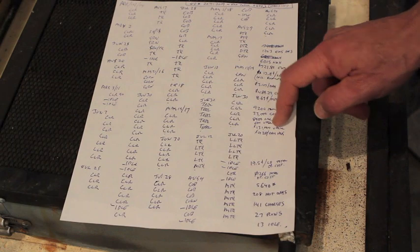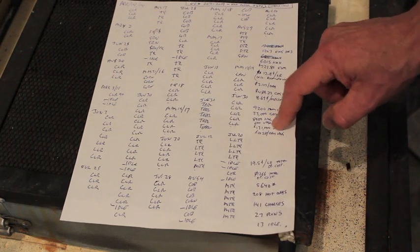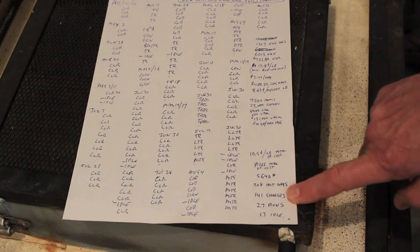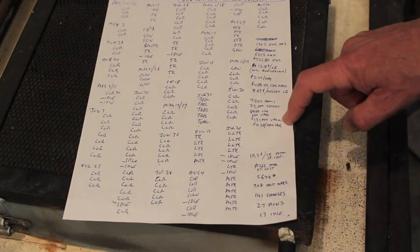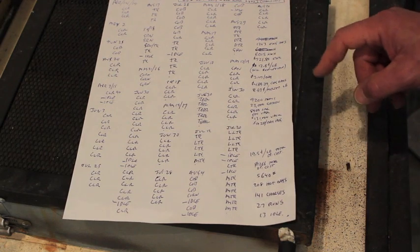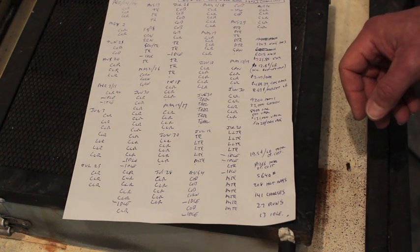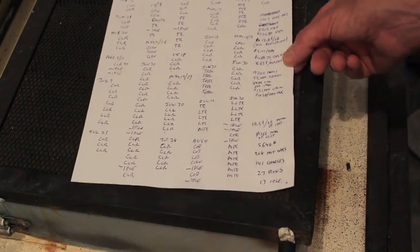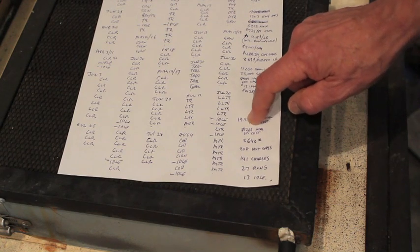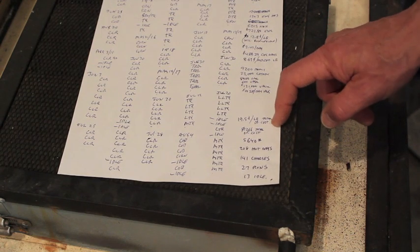A lot of the things I make are small, but they're at least 2 gathers. I made around 600 vases, which are 4 gathers plus punty and that sort of thing. I did a rough calculation that the value of what I made in 141 charges was $131,000, so the average daily production was about $928. I also calculated the cost including a crucible and a set of elements, and it brought my melting cost up to 19.5 cents a pound — that's the total energy cost plus the pot and elements.